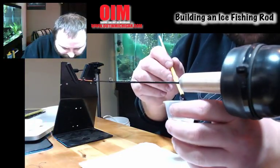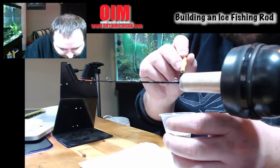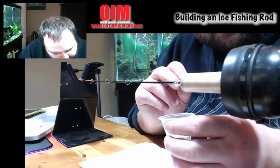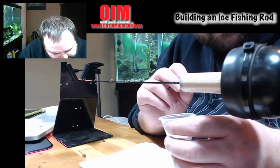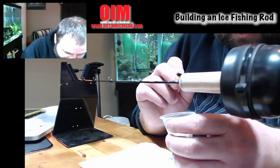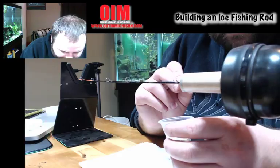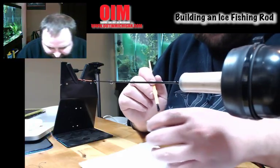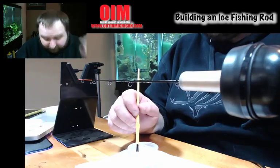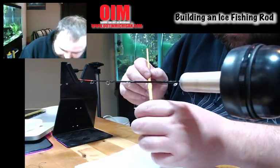Someone asked a little earlier about the motor that I'm using. It does work with every rod, open water, ice, doesn't matter, surf, trolling, use the same motor. I think this is, I forget the RPMs on this one. A rotisserie motor, if you want to make your own, you can definitely do. You can get the CRB one, which we carry on the website underneath the rod building. You can use that guy. That's what this one is. Definitely like it. You can actually change the direction pretty easy if you wanted to kind of suit how you hold everything, and that's what I'm going to do. You can actually stop it, and it will actually reverse. I don't think that's a design feature. I think it's just the way she is because of the cheap DC kind of motor.